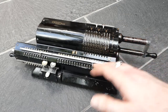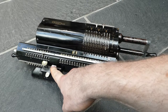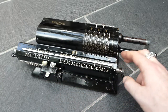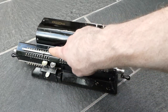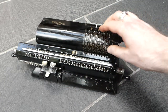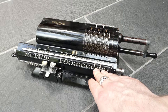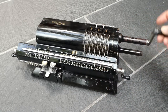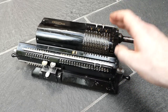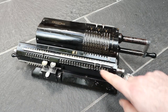For larger multiplications you shift the carriage. You can use these two buttons here to shift the carriage one step — this one will step to the right or step to the left. Now it's on the tens digit position, so each turn of the crank will add this number in the tens position, essentially adding it 10 times. So now I have multiplied this input by 64 and the result is readable here in the main register.